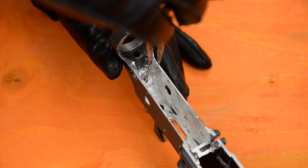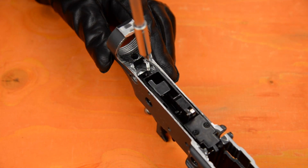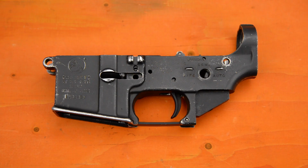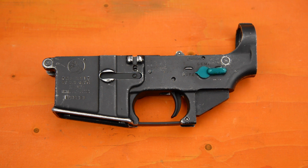Then I tap in 3 mm and install the trigger group with a 16 mm M3 screw, which I cut down to the perfect length. It's rock solid. I will use the Wei-Tech front and rear takedown pins, mag catch, body pin, fire selector, plus the Wei-Tech bolt catch. Everything fits smoothly, apart from the pin for the rear steel bolt catch, which is smaller than the Wei-Tech one. So I replace it with a 2 mm wide and 12 mm long spring pin.